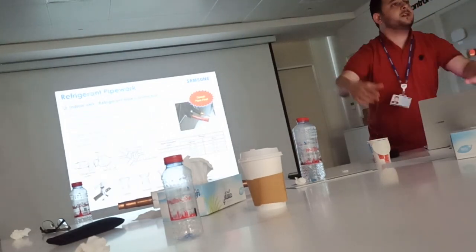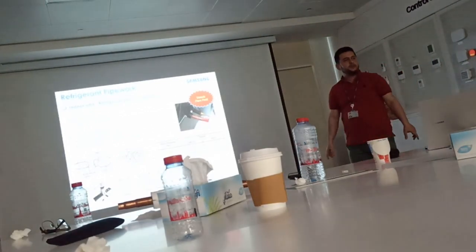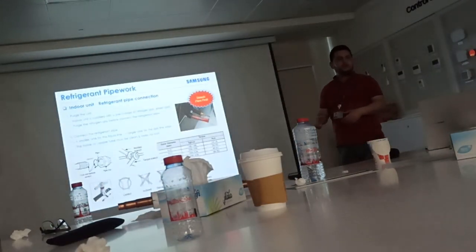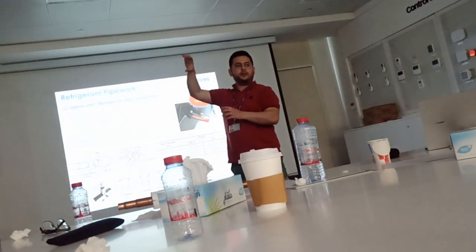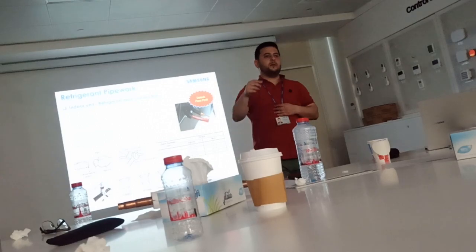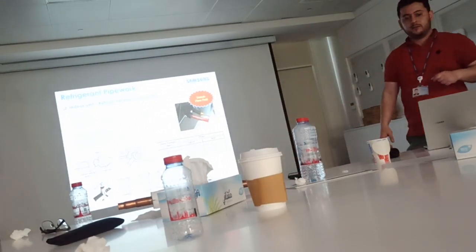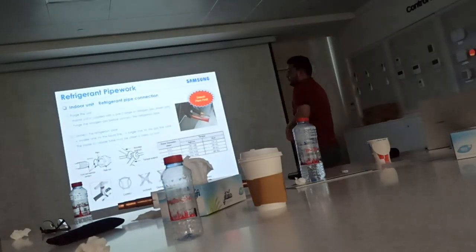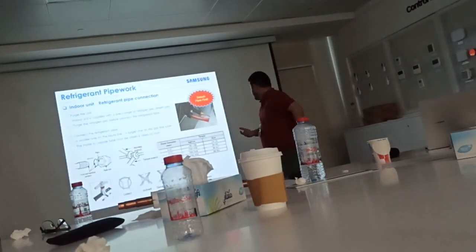Also the support in the vertical line, every 3 meter you need to provide the support. If you have vertical in the shaft, high rise shaft, you have every 3 meter you need one support. The same clamp or channel, whatever you like. But in the vertical pipe, because there is no board here, the board is assisting me all the time.